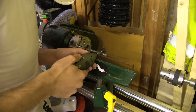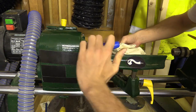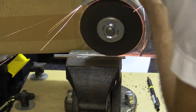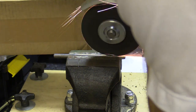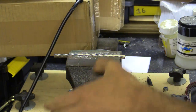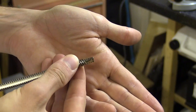I set the lathe fence to guide a small multi-tool with a metal cutting disc so I could make two narrow lines on either side of the threaded rod. I then ground those lines with a larger disc, trying to carefully keep what will be the cutting teeth of the tap sharp. So with the taper facing towards me, that meant slightly tilting the grinding disc to the right. I then used a file to clean up some of the burr, and also ground a square end to fit the tap onto a handle.